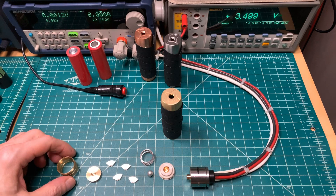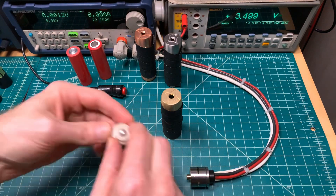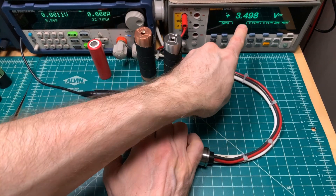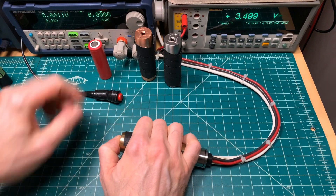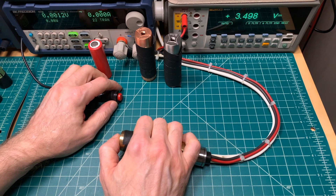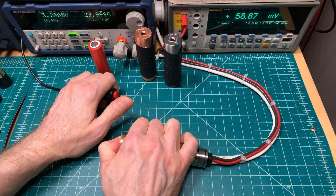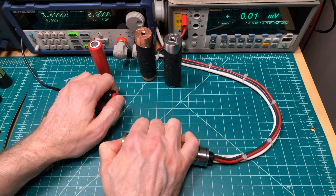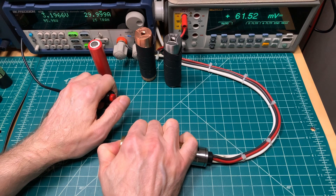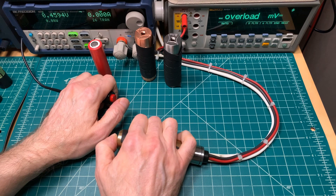Grease cleaned off. Let's put the button assembly back together again. We'll check for zero volts when I press the button — yes. Firing a two-second pulse. The brass did 0.25 volts, about 6.7 watt power loss at 105 watts. Let's see what it does now. Reading 0.055. That's a little better — 0.06. That's actually a little better than the Tauren Max without grease at 0.061.